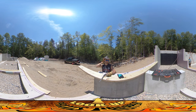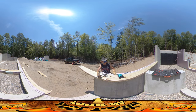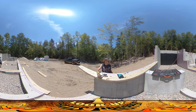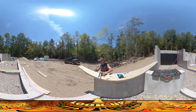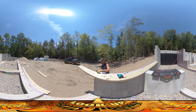...it's called a moisture barrier — yeah, there's an insulated barrier that goes between the foundation and the pressure treated wood to kind of block the cold a little bit, block any drafts. That's not a real issue because we've got foam on here, but also to block any wicking of moisture. So we're essentially just getting them all cut to size and put down on the foundation.